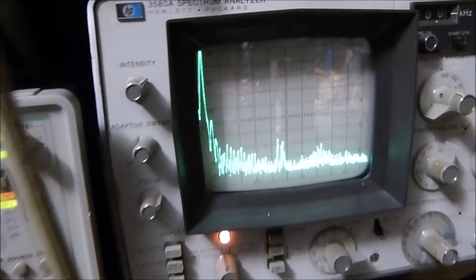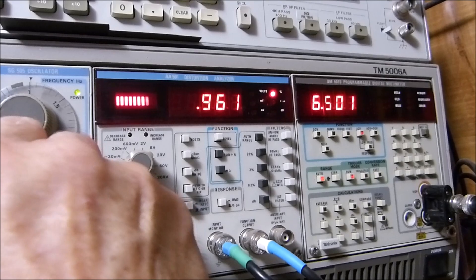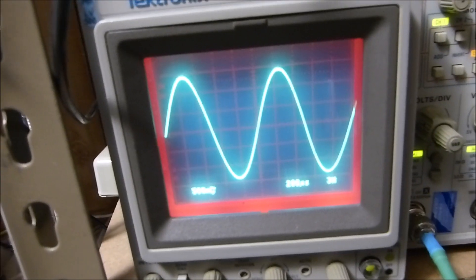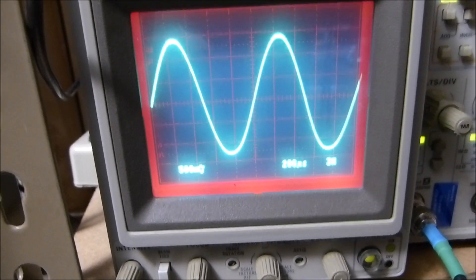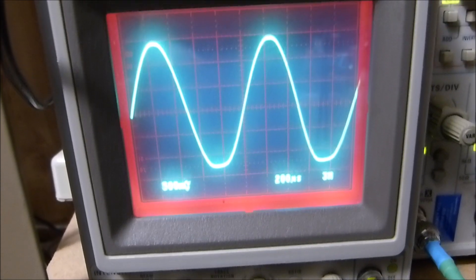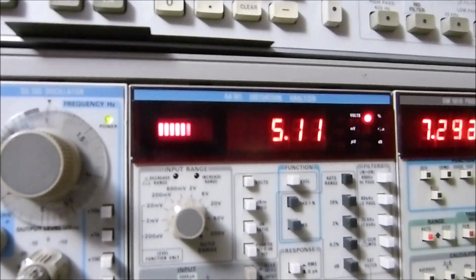The harmonic profile — there's just some noise in the room, not actually coming out of the amplifier, so it's quite clean. If I turn it up to where I get 1% distortion, right before clipping, that's about 5.4 watts. At actual clipping, you can see the bottom bulging out — that's 6.5 watts and we're up to about 5% THD.